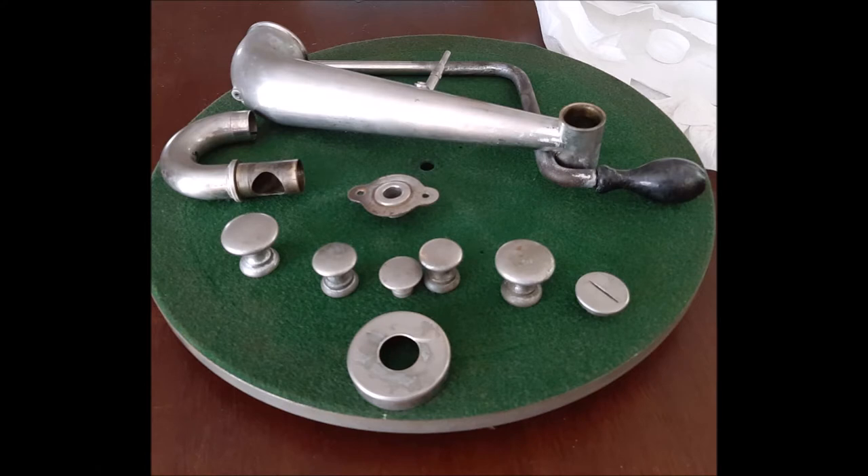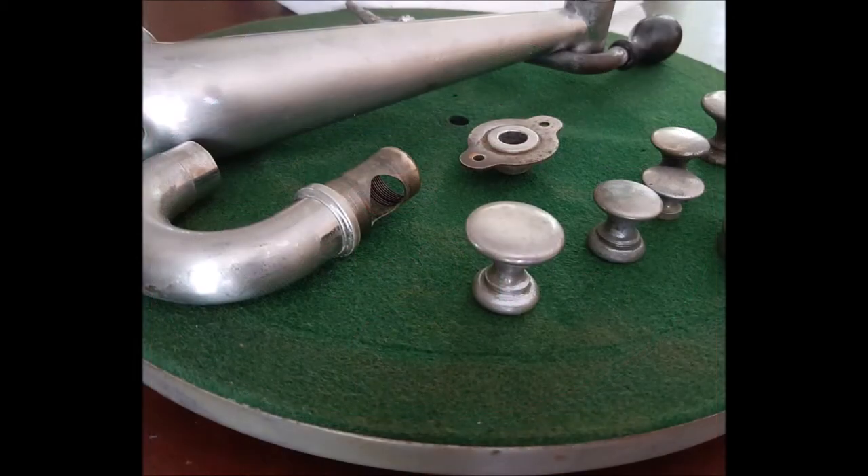Now we go to the preparation phase — this is preparing your parts for proper plating. All surfaces must be highly polished and thoroughly cleaned with no corrosion. You can use a mild abrasive cleaner polish such as Soft Scrub or Dawn to get them clean. Do not touch the parts with your fingers after cleaning. Insufficient cleaning before plating will cause the plating job to fail every time. After cleaning your parts, run them under water and note how the water comes off. If it beads up anywhere on the part, like on a waxed car, it's not clean and you should repeat the cleaning steps.